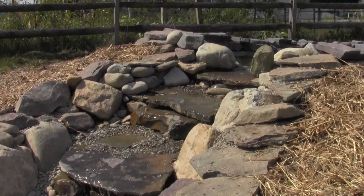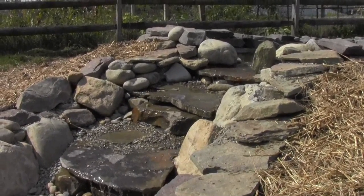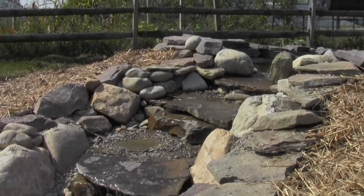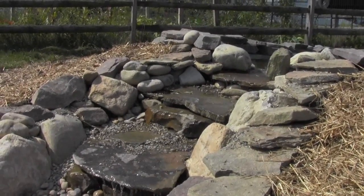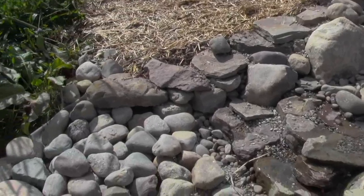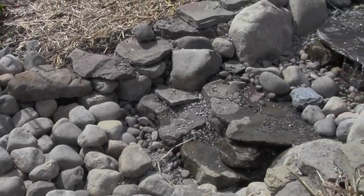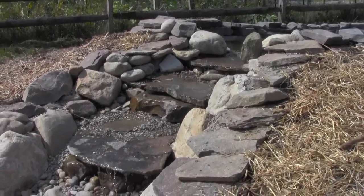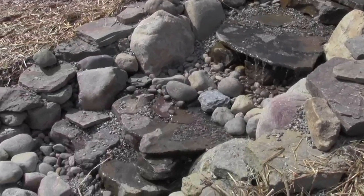This is the exit to the pond, and we actually get a fair amount of a nice little waterfall going off — and that's just from a hose, so imagine how much water flow we can get with a good-size rainfall plus the gray water wetland plus all the drain pipe and swales and surface runoff. I think we can get a pretty nice flow. Another reason I wanted to have a nice little waterfall before this water gets into the pond is it will help to oxygenate the water. I've just started stocking the pond — I put minnows in last weekend to get them to spawn and hopefully grow before I stock it with my edible fish. Having oxygenated water coming in is certainly nice for them.